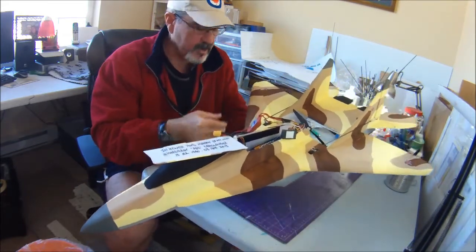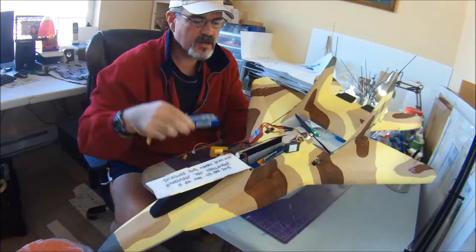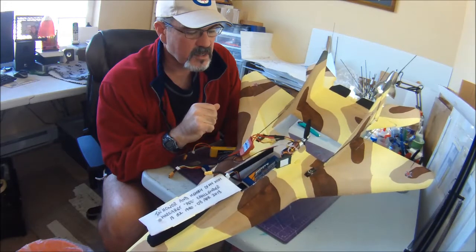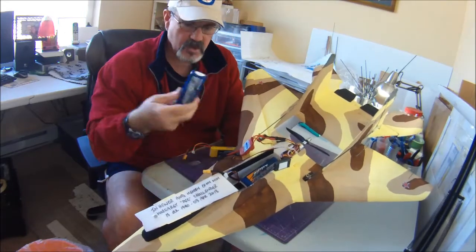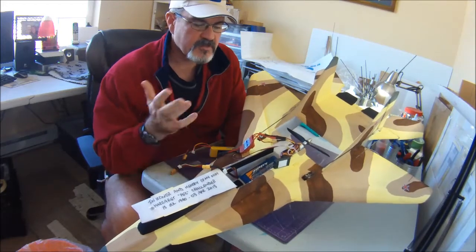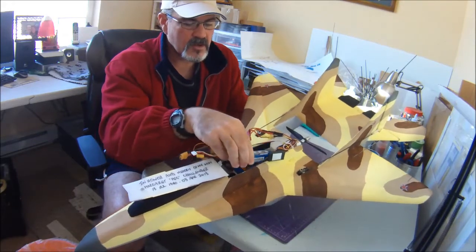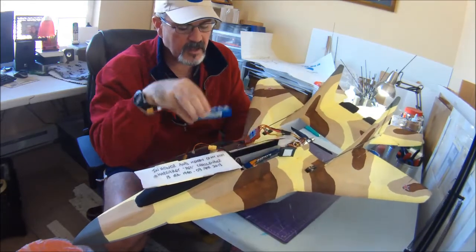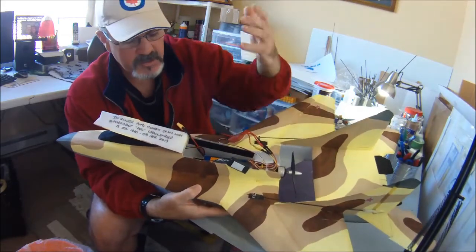So by starting off, if you've got lighter 2200 batteries like this, or 1800, 1600, if you're running this motor, or let's say you're running the Turnigy 2826 2200 kV motor, the one that's on the RC Power's master parts list, with an 1800 milliamp battery, you're going to get 5 to 6 minutes flying time, depending on how aggressive you like to fly. And then again, it'll be right up against the back of the electronics bay. And then, as I mentioned in my walk around video, you can put your speed controller and your receiver on whatever side you want.